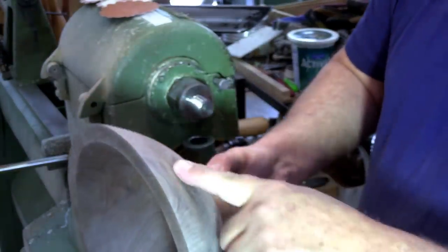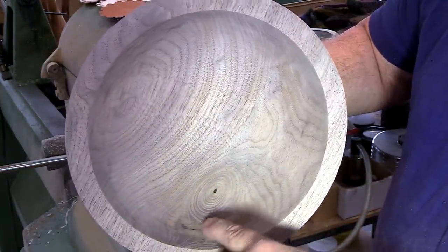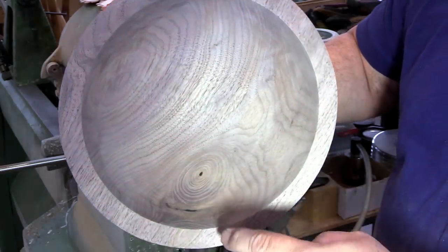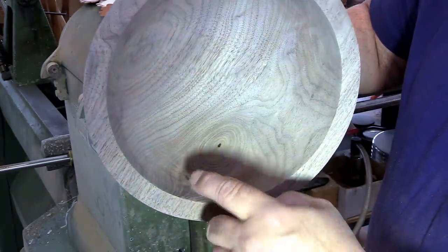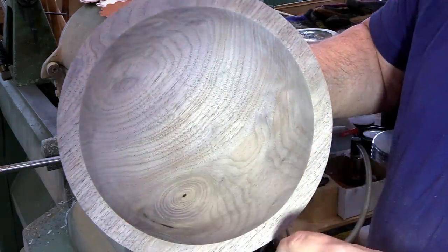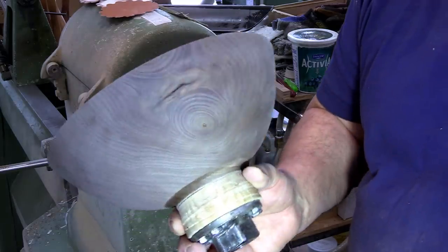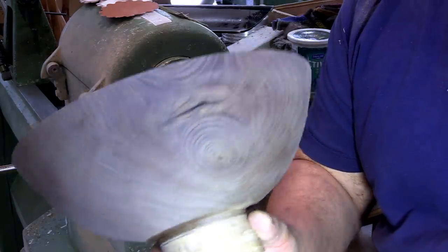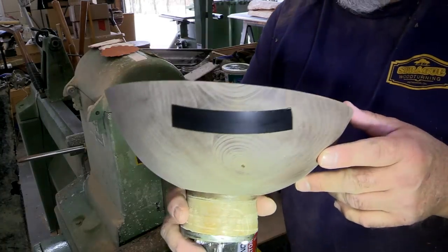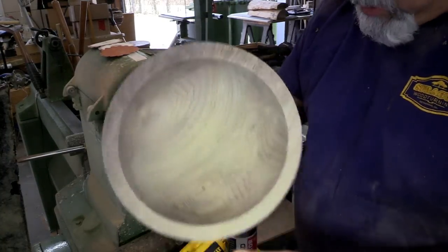So anyway, I'm going to throw some electrical tape on the backside of this, pour from this side, set it up, hit it with the accelerator, and then I'll set this aside, trim some other ones, and then hit it with the 180 grit just to clean it up. And then hopefully this will be all filled in and we'll be able to sand to 320. So there is the tape on the back side so the glue can't run through and stain the other side.